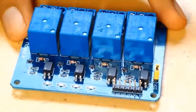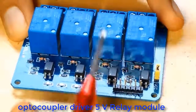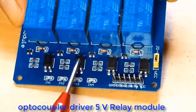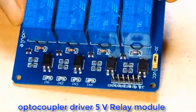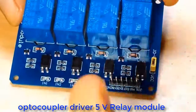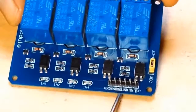What you are seeing is a 4-module relay. These are basically relay parts, and here are the optocouplers. The working of an optocoupler is that it consists of a photo transistor. Whenever a 5V control signal is given from pins 1, 2, 3, 4, which you are seeing here, a LED inside the optocoupler switches on.